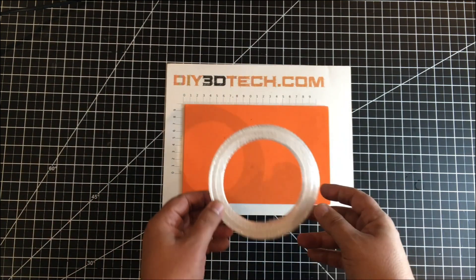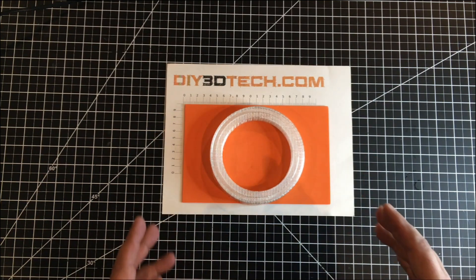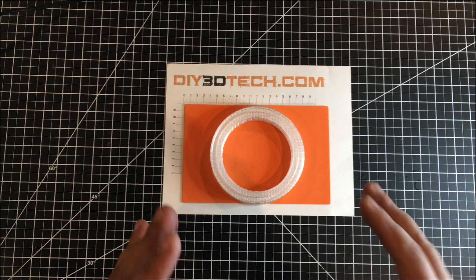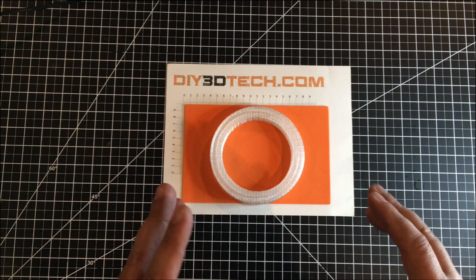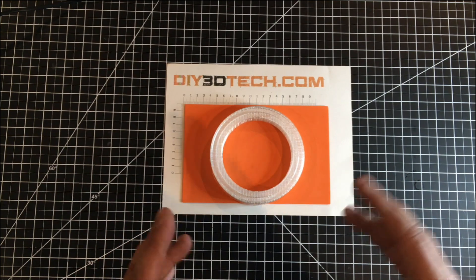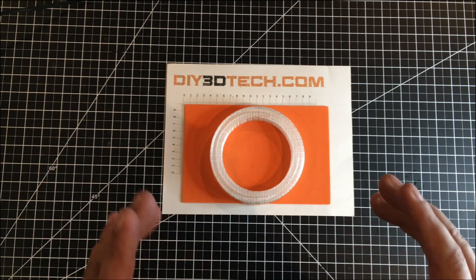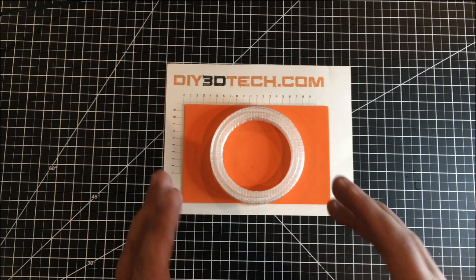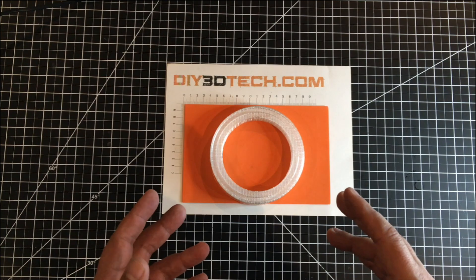The piece with this is I turned to TPU. I really like working with TPU — it's one of my favorite plastics for production activities. Yes, it is a little bit flexible, but in this case and in a lot of cases like this, flexibility is good. It stands up to high temperatures; this is going to be on the front porch and will get rather warm in the summertime. PLA would not stand up to this, ABS might, ASA or nylon probably would, but TPU definitely will. It also holds up well under UV light, and while it won't get too much light on a covered porch, that's still a good thing for being outside in the elements.